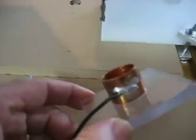We've got two simple tools that you can make: just a piece of aluminum angle iron with a lead hooked up to it, and a one-inch piece of copper pipe with a lead soldered onto it that's been inset into a piece of plexiglass. The plexiglass has a crosshair scribed on the bottom of it, and the way this works is you move the crosshair over a position on your workpiece.